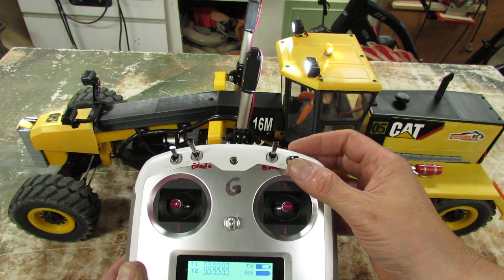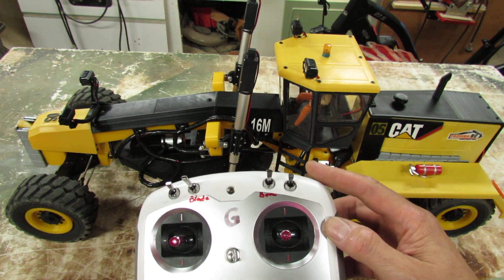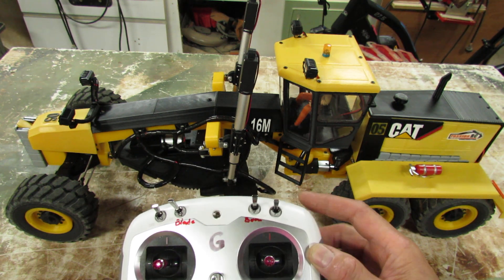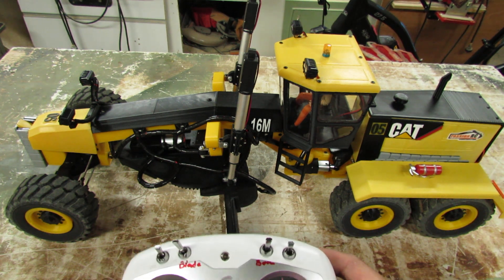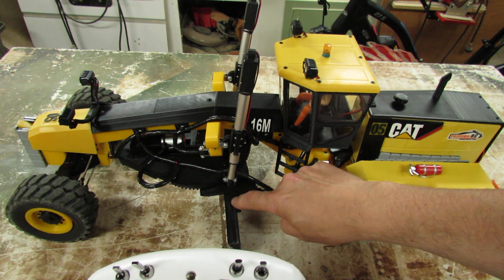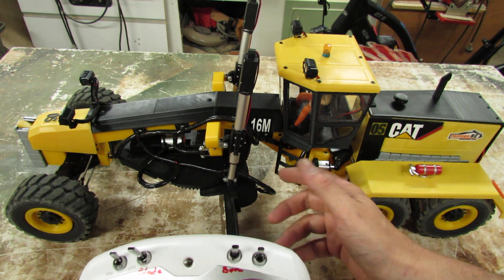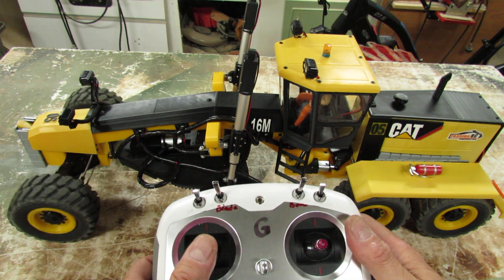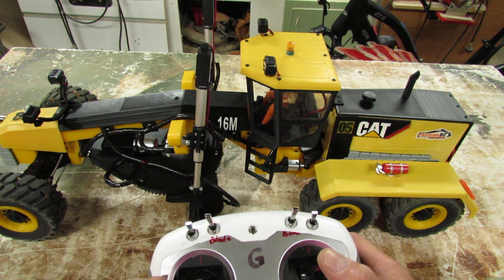So you get the light, get the boom, get the blade turning, get the blade left and right. You have to be careful to clean up this little part often, because sometimes the sand goes inside and you will hear the actuator work very hard. This is turn left and right, up and down, and this is the blade going.